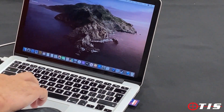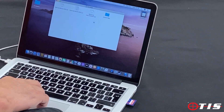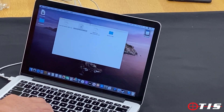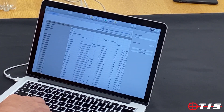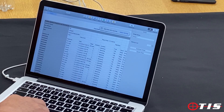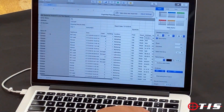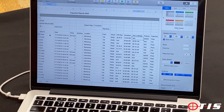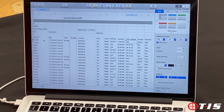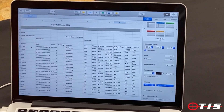The SD card is in the laptop and it will bring up an icon. Click on the icon, then 'exported results', and that loads up on the screen. As you can see on the left hand side we've got the appliance ID, the actual appliance, the date we did it, what it was, building number, workshop, view type, pass, and all the results. That is all on an Excel spreadsheet. You can export that to an Excel file and email that document to your end user — and obviously get paid for the job. That's how easy it is to download using the SD card.